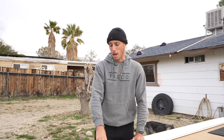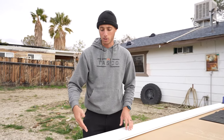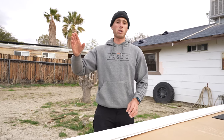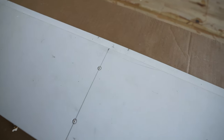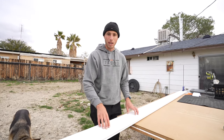Finally, we're going to do something that actually makes the truck look nice. Now that we've wired our overhead lights, put the furring strips up, and put the insulation up, it is time to put our shiplap boards up. These are 12-foot boards, so they almost run the full ceiling. We've already measured out all our studs in the truck, so all of our screw holes need to line up with the furring strips. We lined our board up, traced where our first stud was, then measured all the other studs inside the box and drew their center points on the board. We have 11 studs in the truck, which means 11 points of screwing each plank in.